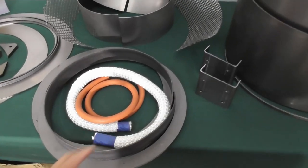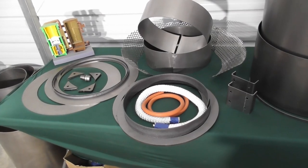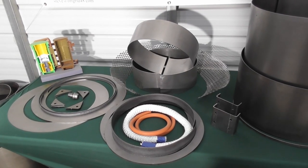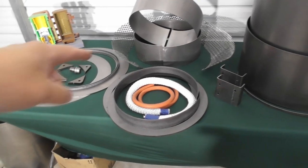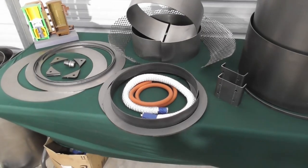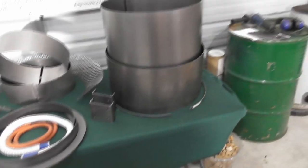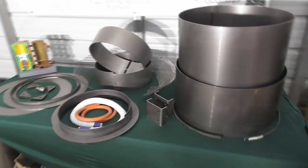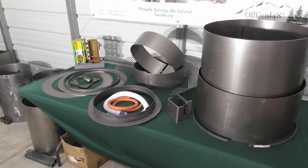Additionally, we use a one-inch fire rope that you put on your reactor in between the condensate liner and the top of the reactor. When we place the hopper on top of the reactor, we don't want fuel falling down into the condensate liner where the moisture is collected, so the fire rope stops wood from falling into it. The build is pretty simple. You can build it to three different sizes, and we also offer it as a complete build. Good luck on your builds, and we'll see you on the next one.